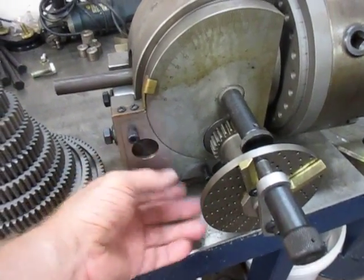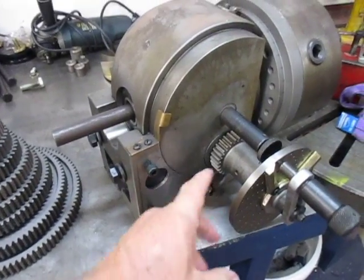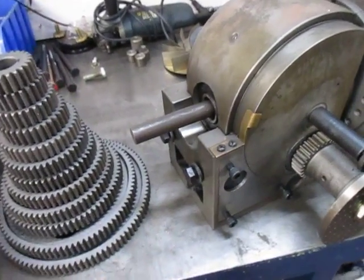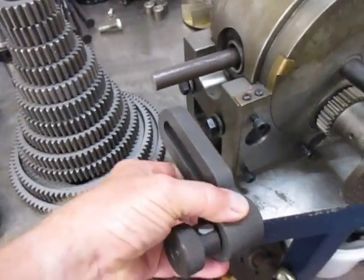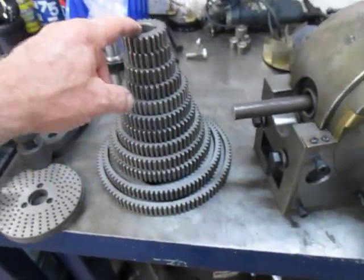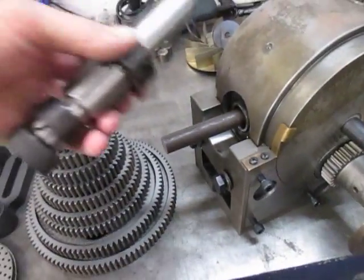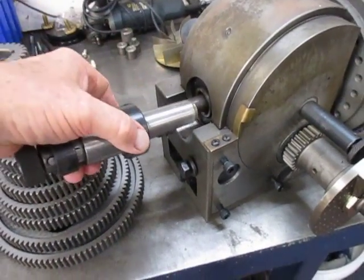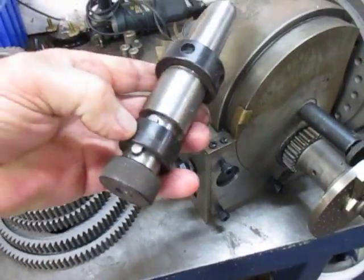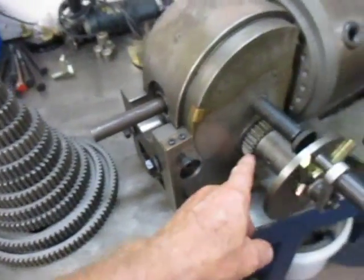The shaft arrangement is not on here at the minute, but there are two ways it can work. One way is that shaft arrangement comes out and connects into this gear. Then there are these banjos — banjos can be bolted on — and through the correct gearing you've got the ability here of having two banjos. By fitting this shaft in the back there on a Morse taper, you can put another gear on here and drive that gear arrangement.